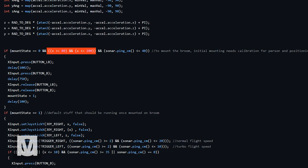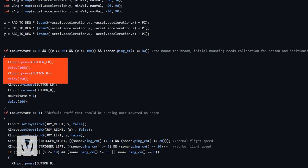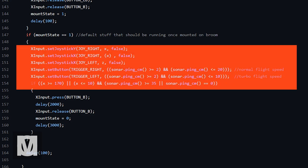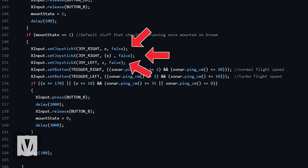The third condition is that the ultrasonic sensor must detect my torso within a 40 centimeter range of the sensor. Once all three conditions are satisfied, the Arduino sends out an XInput command to mount the broom in-game — it will hold LB, wait one second, press B for three-quarters of a second, then release both buttons and change the mount state to one. At this point you should be in person mounted on your broom while your character is doing the same thing in Hogwarts Legacy. In this section of code, six lines become activated once the mount state becomes one. The first three lines relate to the pitch and roll movement of the Nimbus 2000 and associate it with the in-game broom — the XInput joystick is mapped directly to the X axis (pitch) and the Z axis (roll).